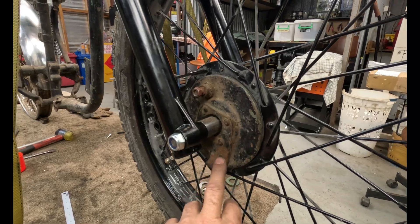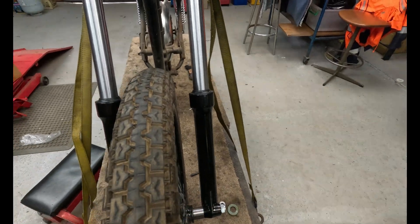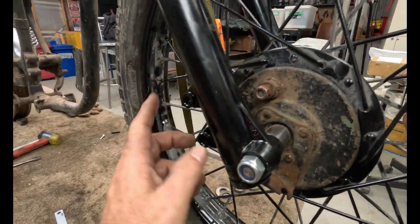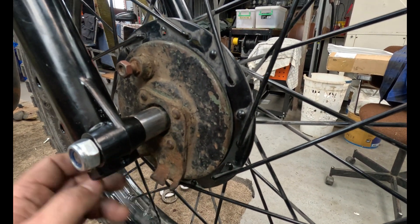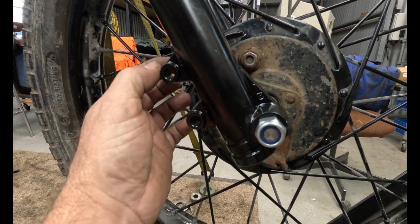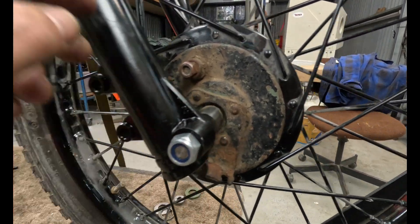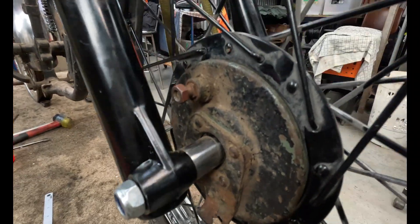I've fitted up the brake backing plate in there. Obviously it's upside down. I just modified my spacers either side and got it really nice and central. I've just done a measurement over to the lugs from this face here and I'm about to start making up a new plate. My mindset is to make a couple of cylindrical threaded bosses here, so we can bolt straight through into the threads in the bosses. And then the plate will have a little bit of a dogleg to come through here.